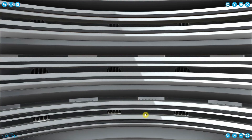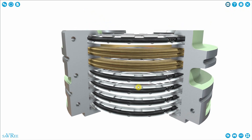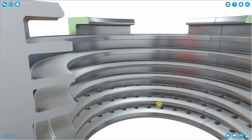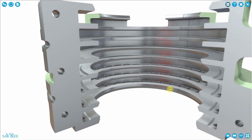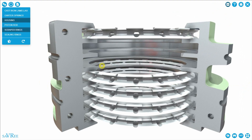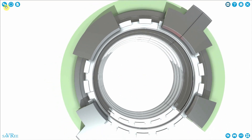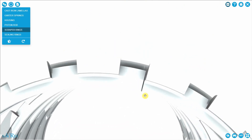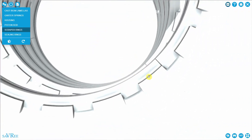So we've got scraping of cylinder oil and debris at the top of the stuffing box, sealing of gases in the middle stopping scavenge air and exhaust gases from entering the crankcase, and then a series of scraper rings below that to scrape off lubricating oil from the piston rod. The stuffing box housing allows us to install the rings and holds them in position. You can see the grooves here — each groove is manufactured to house one of the rings. The rings also show thin lines, indicating they are segmented.